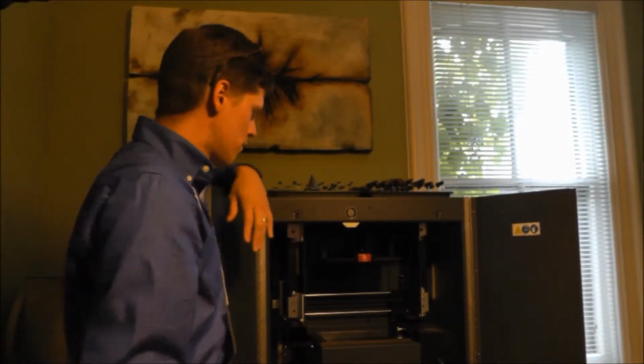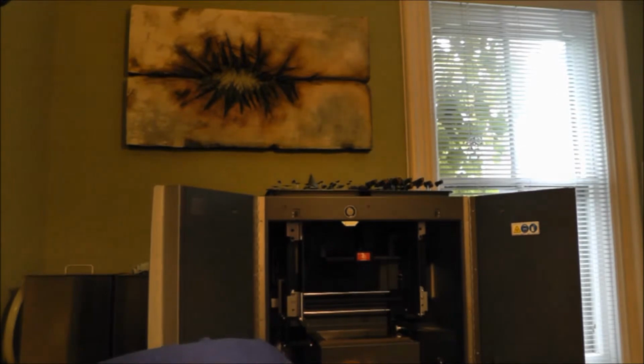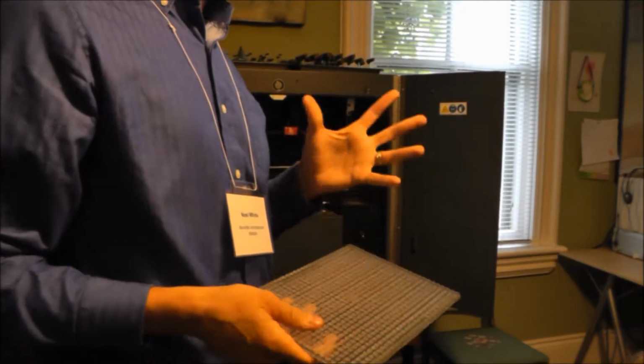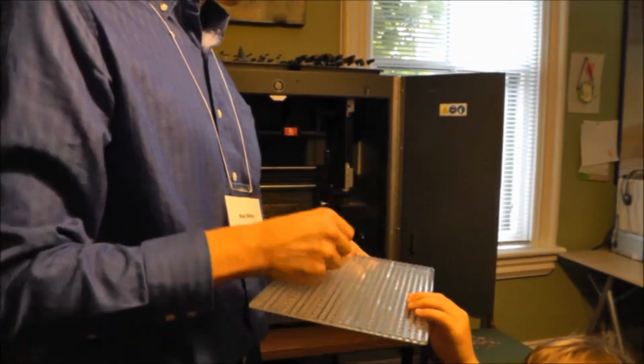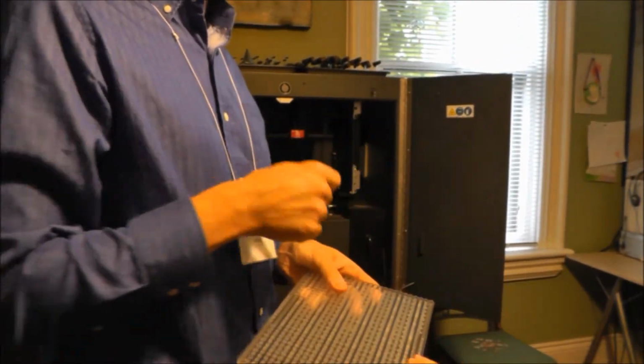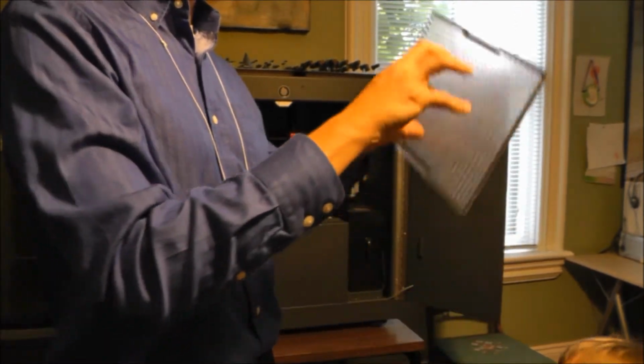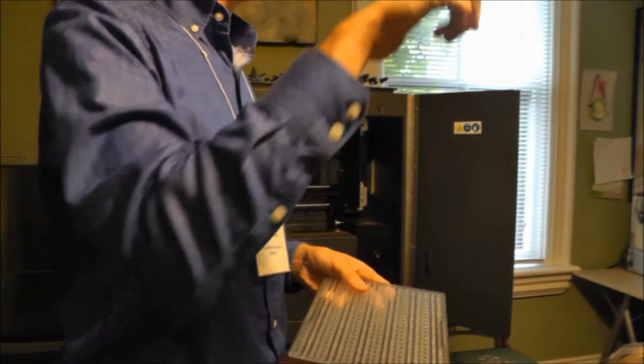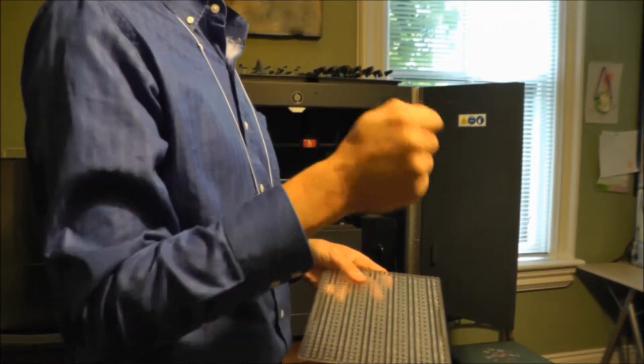That's right, yeah. These are the pads here. But you can make it in pieces and assemble it afterwards, right? That's right, exactly. So you can do multiple pieces, and sometimes that's a good idea too, because what the computer will do is build supports. It will decide where to put these supports so that your object doesn't fall off the pad while it's being constructed. And so you have to go back and snip off these little supports.